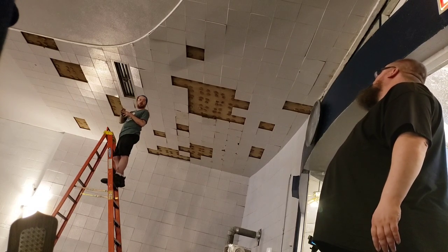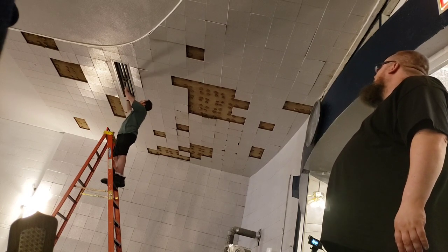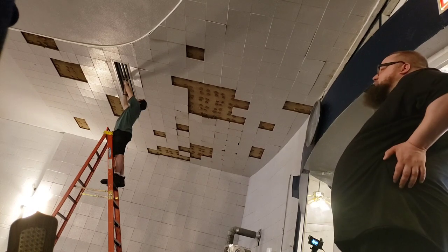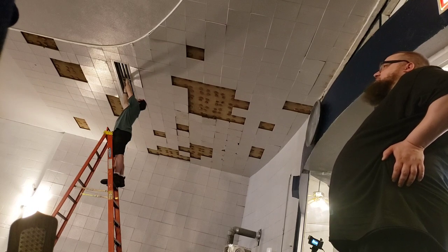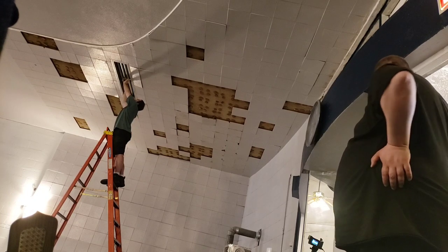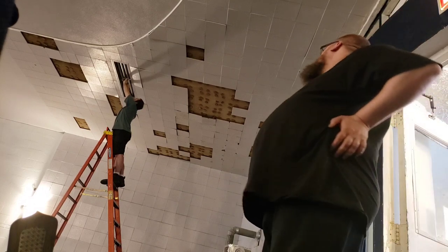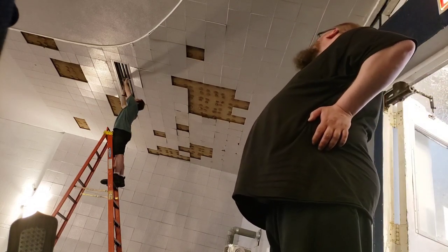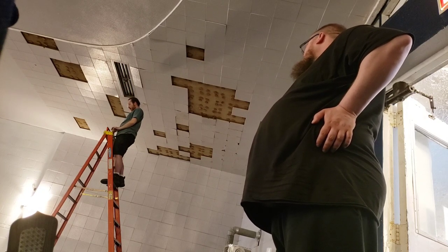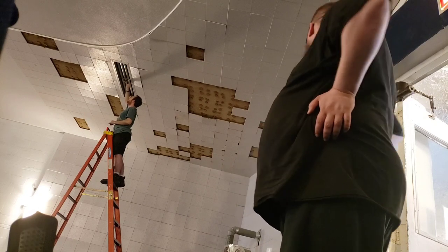Let's make sure, cap off those wires, let's make sure everything still works before you hang the fan. Or even just make sure they're not touching anything, but capped off is better because if you want to reach up in there and fiddle with something, you don't want it. Well, I have to cap the wires so I can follow up. I have to cap the fan. Okay. Would you rather hang the fan first? Okay, I'm going to put two wire caps and then get the power again.